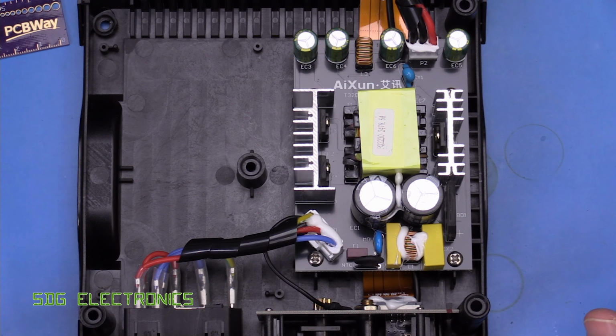And we've got various optocouplers here. I think this is for level shifting for high side driving of these transistors just here. It seems to tie in very closely to these transistors, so that's all I can assume it's for. Certainly, with no isolated power supplies on here, they can't be isolating the thermocouple reading that would alleviate that issue that I was talking about earlier. So I think this is all just to do with driving these transistors. But really quite a complex board compared to the old T3A and T3B. It looks like they've made many changes here that should really make this quite a stable system.